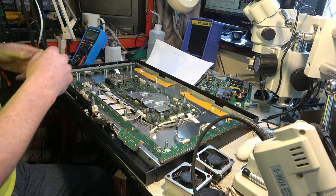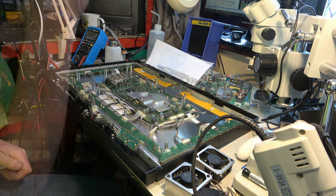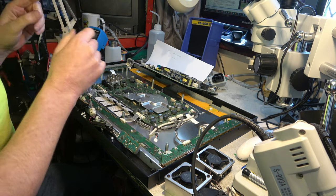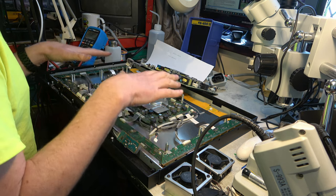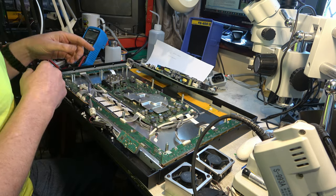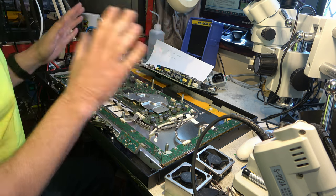Somebody said perhaps you should start by making sure the backlight is working — it's an OLED panel, there's no backlight. Apart from a few block diagrams regarding the power supply arrangements on this board, and even they can't be trusted — I believe there may be some mistakes in them — there's more or less no service information on this panel. So if the IC in question is not working because one of the major ICs is telling it to not operate, then we're stuffed because there's nowhere further we can go.